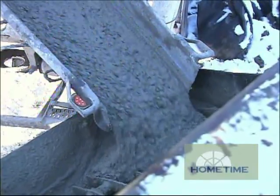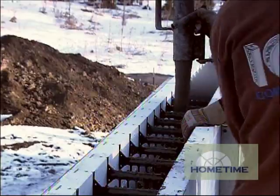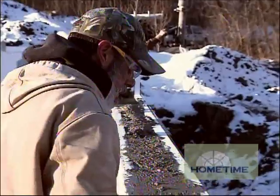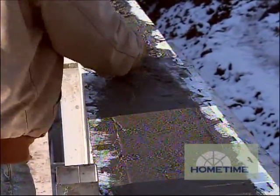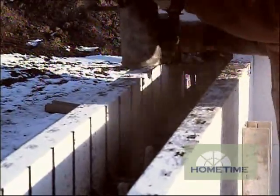So what do you mean by slump? Well, slump is how they measure how fluid the concrete is. The higher the slump rate, the looser the concrete. If it's too loose, you build up too much pressure, and it ends up with not as strong concrete. And if it's too thick, it probably plugs up the holes, and then we have a hard time consolidating it.